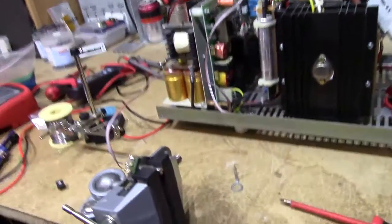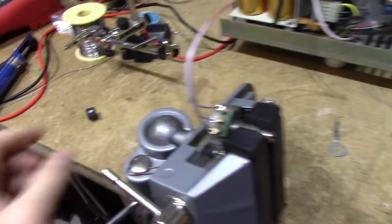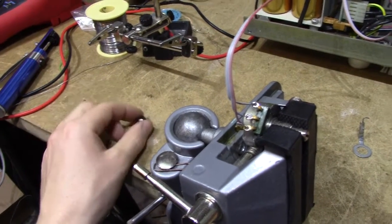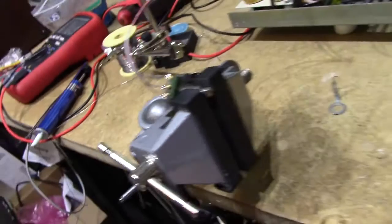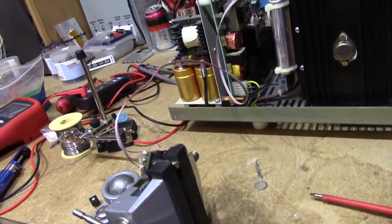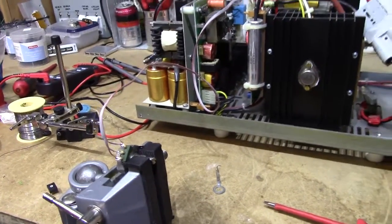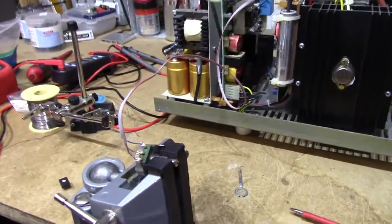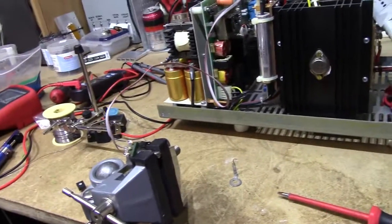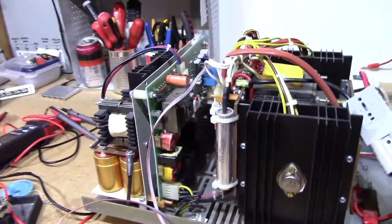Anyway, I've added an external potentiometer — an ancient 10K, same as the original 10K — and I've got it very securely mounted now for a test run, because I don't know if this adjustment circuit is on the primary or secondary side of the regulator. I'm hoping it's the secondary side, but I don't have too high hopes since there aren't really any optocouplers on this board.